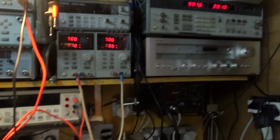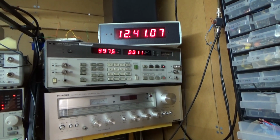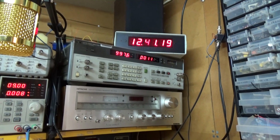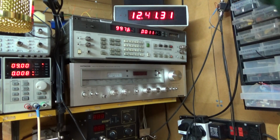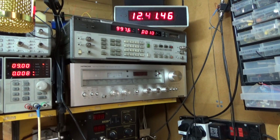I was looking at my audio analyzer up there with its 4 digits of resolution below 1%. And this thing of course will not stop moving around. And just because it's got 4 digits of resolution doesn't mean you're going to be able to see below 0.001%. Because as this person pointed out very helpfully, he read the manual on the 8903, which is quite an achievement, as it's several hundred pages long, and he said it's got a specification of 99 dB in logarithmic mode.